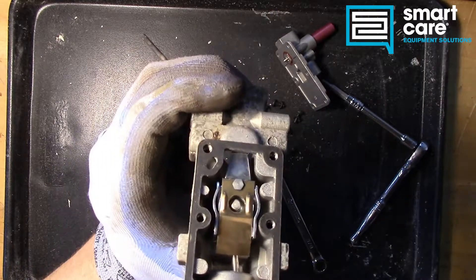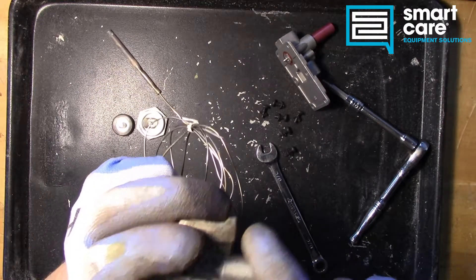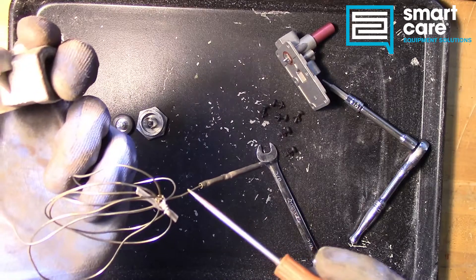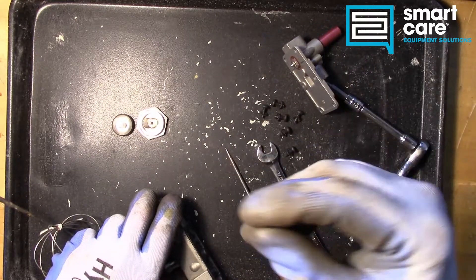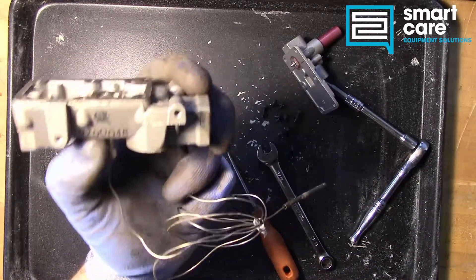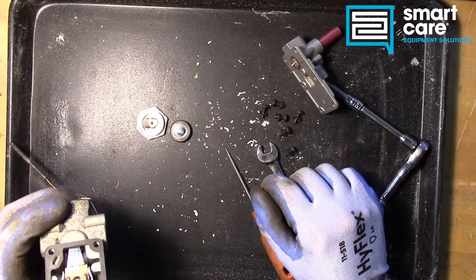Once that mercury is heated up and the bellows has expanded, this arm shifts and moves, and that causes the gas to flow through the valve and maintain our pilot gas flow. It's a pretty straightforward, simple system. These were very reliable in their time — you generally didn't have problems unless the cap tube and bellows leaked. Sometimes the pilot wouldn't hold a high enough flame temperature to keep the bulb hot, so people would replace these for a partially clogged pilot, not necessarily a bad flame safety. The other potential failure was the rubber seal starting to fail, causing continuous gas flow even when the valve was supposed to be closed, but that was a pretty minor problem.